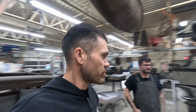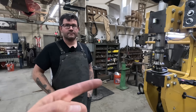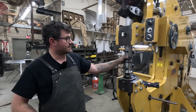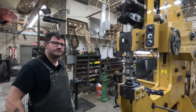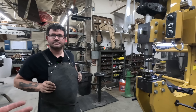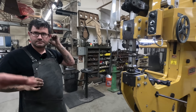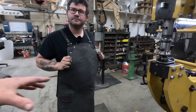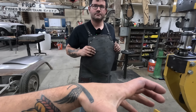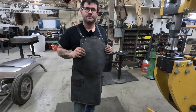I've got a lot to learn here, so I'm going to try and ask as many questions as possible. What kind of tooling do we have on here right now? A 36-inch lower and a flat top upper anvil tool. The process of doing a low crown panel — the way you've laid it out on the templates — is we start from the center out, go over the smallest square first, and then it'll be twice over the center when we go to the next, and so on.